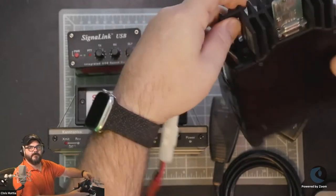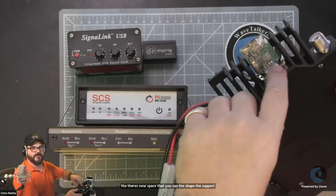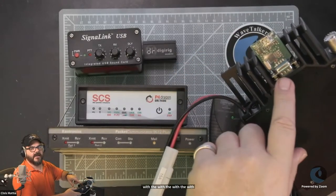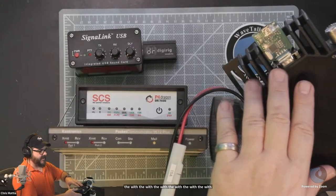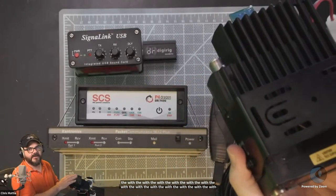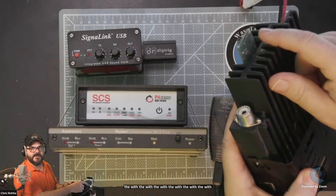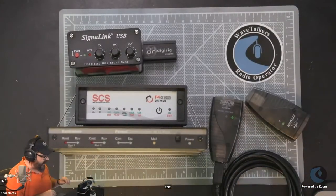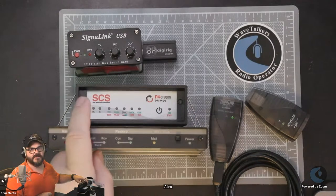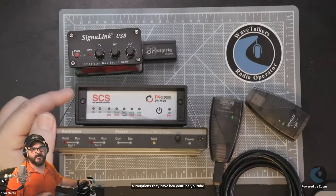So if you're building this into a mobile deployment, you may have a challenge with the board coming out. However, for a VHF gateway — a two-meter gateway — these Alinco DR-135s are relatively cheap and this is one of the cheapest interface options. I also have here my SignaLink and my DigiRig. I also have my Pactor — this is a P4, the DR-7400 — the lower-cost of the two P4 modems. Now that amateur radio operators are allowed to use Pactor 3 and Pactor 4, these start to make more sense.